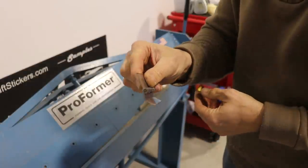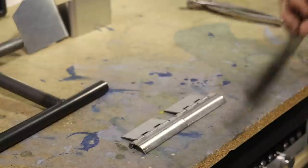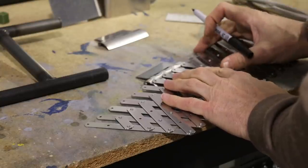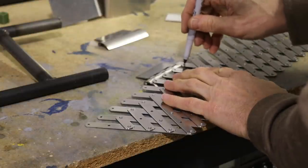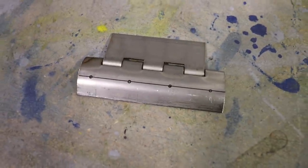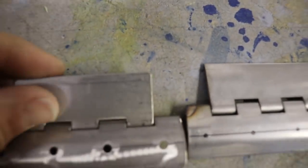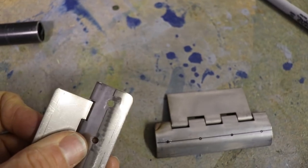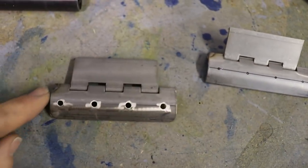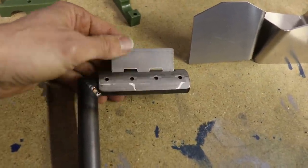Here's a finished one and it looks pretty good. I'll draw a line down the center of each of them — that's where the line of rivets will go. Find the correct position on the rudder pedal, and I'm using my rivet fan to evenly space four rivet holes on the back of the hinge. It's a really handy tool. I have two hinges here — one is done with rounded corners, and the other still has sharp 90-degree corners. Now these are nice and round, not sharp, and the holes are drilled. All I have to do is match drill it to the rudder pedal.